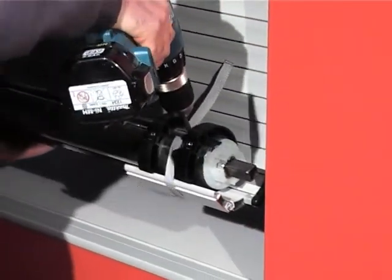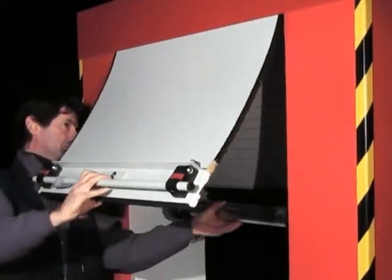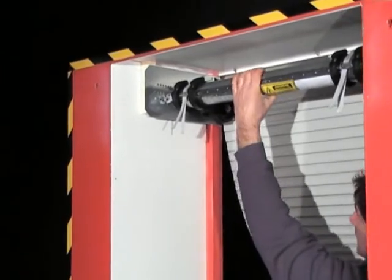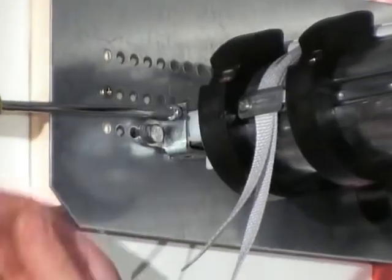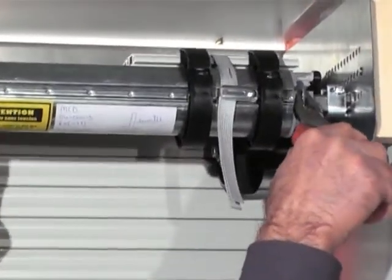As a reference, the label on the roller should always be placed to the right of the shutter, when seen from the inside of the compartment. Once this operation has been done, slide the shutter against the wheel again to lodge the roller square in its roller support previously installed on the side panels. Next, close the roller supports with the corresponding screws.